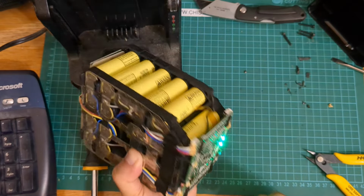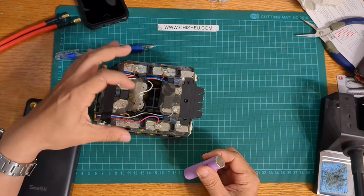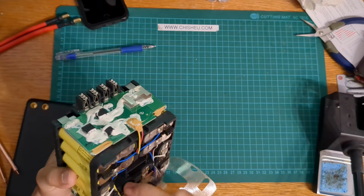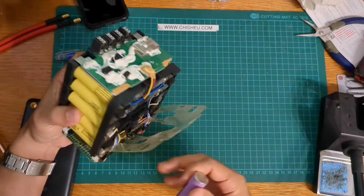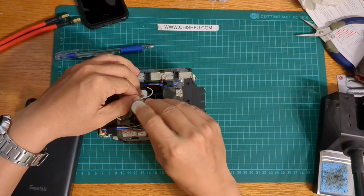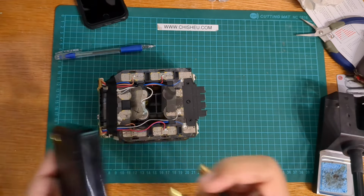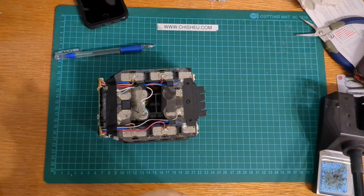See if it's got two bars. With the last episode, we found out where the problem was, and we tried to burn this in, but we weren't able to do it. We weren't successful because the nickel strip is either too thick, or the little machine that I have right here, the contraption, is not powerful enough even at its highest setting.